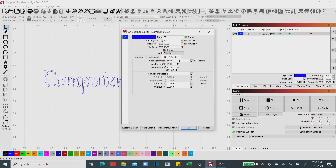This is a completely separate setting for a tracing where the laser head actually traces the edge of your text. Depending on your minimum and maximum powers, it will sharpen the edge, and depending on your settings you can actually get a dark to black line that goes around the perimeter of your text, making it much more easy to read and pretty striking. So this is what we're going to play with today — Fill Plus Line is an awesome feature in Lightburn. Let's go check out some examples and see what you think.